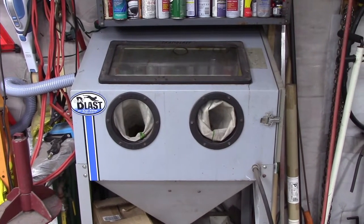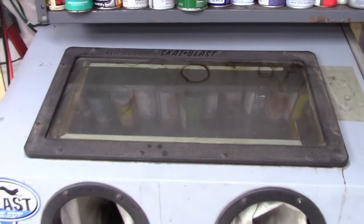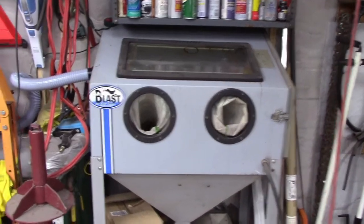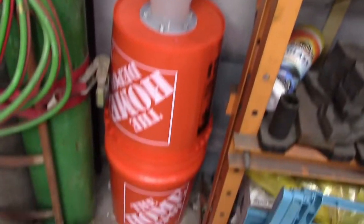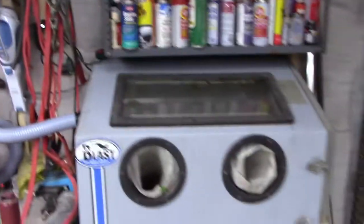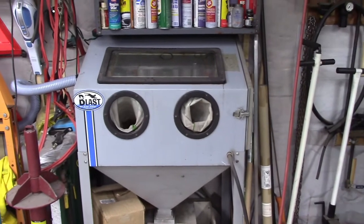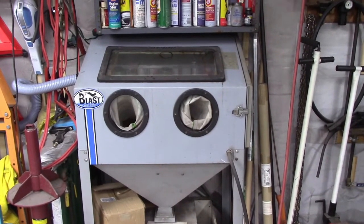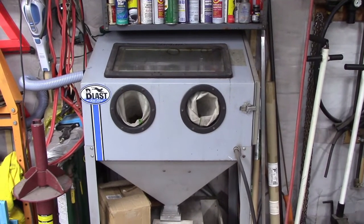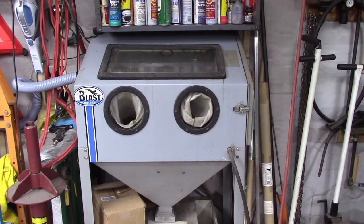All done and I'm very happy. Initially I could barely use this blast cabinet — I'd have to hold my breath for 30 seconds, use it, walk away, and let the dust settle. Now everything is sucked out through the vacuum hose into the Dust Deputy. All the debris drops down into the bucket, and the vacuum up there has a filter in it and blows out clean air. Now I can run this thing for long periods of time, blasting and cleaning parts, tearing rust off of stuff, while being able to see inside much better and breathe the whole time. I'm calling this done and a success. There you have it — thanks for watching.